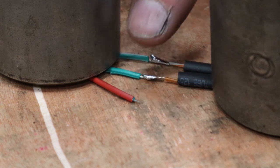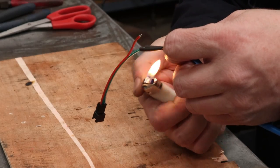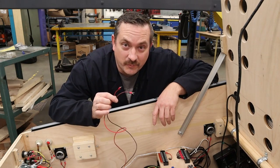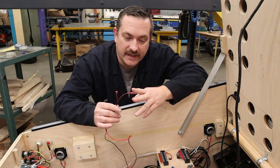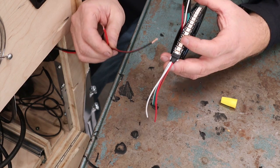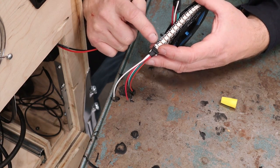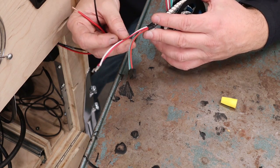The red wire is for our 5-volt supply, but we don't have to wire it here on each LED strip — there'll be a separate spot to plug in the 5 volts later. For injecting 5-volt power into our LED strips, I've got black and red 18-gauge wire with fork connectors crimped on one end for the ground terminal and 5-volt terminal strip. On the other end, we attach them to our LED strip — making sure we put it on the going-in side, identified by the arrow pointing into the strip.